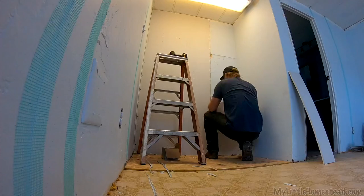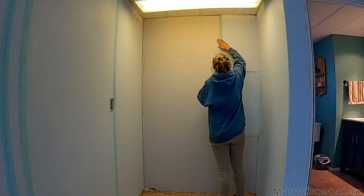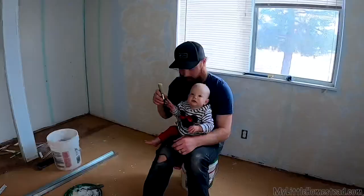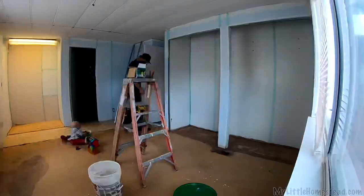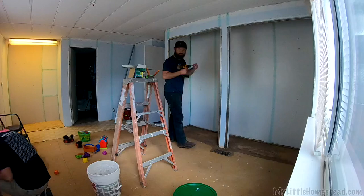I got the sheet rock on, so I just taped these seams up. There is a bit of a gap from the paneling to the drywall, but nothing a little mud can't fix. Did some of this corner flashing — it didn't have any before — and we're not going to put any more trim back up around the closet. I'm going to get this screwed on, and she's been getting all the tape done. On that wall I like everything textured, but Garen had the brilliant idea that we should hit the seams first, let that dry, and then texture everything.